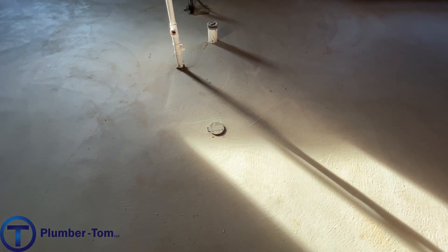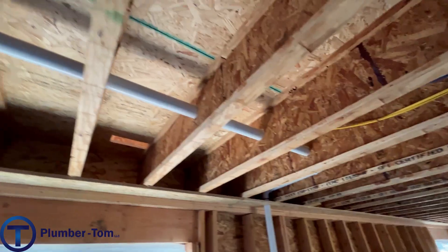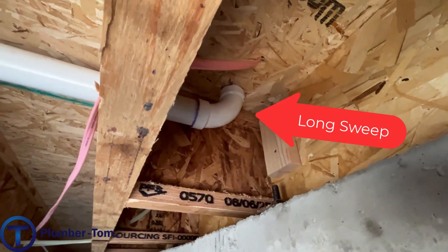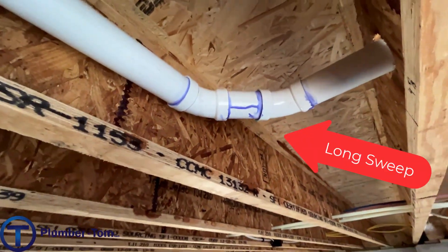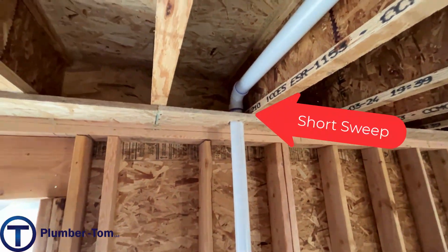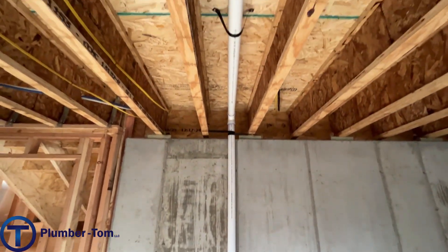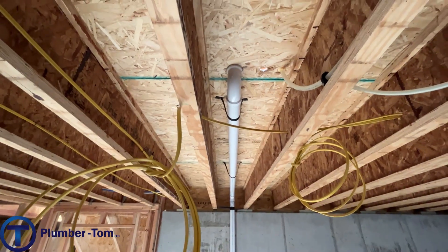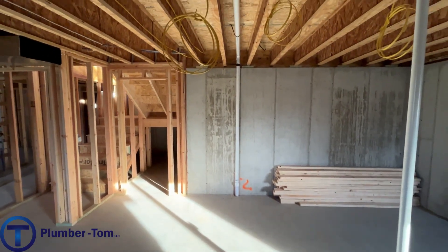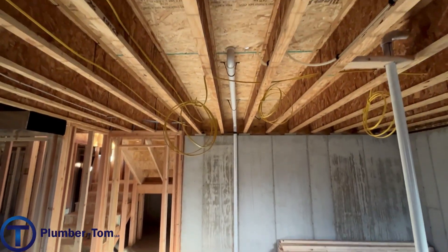When it's all framed in, that backwater valve should sit right under the cabinet — I think that's what the plumber was planning. The laundry drain comes through the joists and 90s up using a long sweep — as they should anywhere vertical to horizontal. Two long sweep 45s equal a long sweep, so that's good use of fittings. The kitchen sink drain came up right against the foundation, runs through the joists, and is secured up into the cabinet. This plumber knew where to put that pipe underground from the very beginning, so it came right up into the joists without any awkward offsets — great planning.